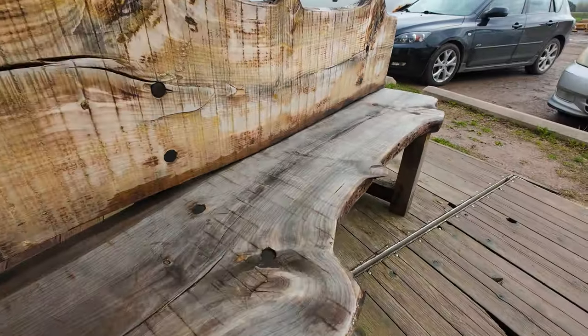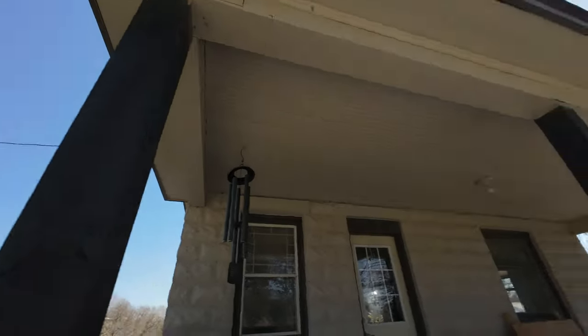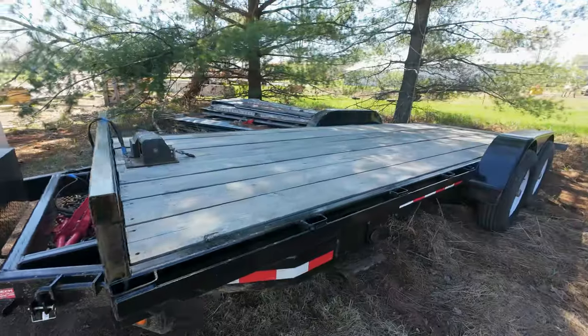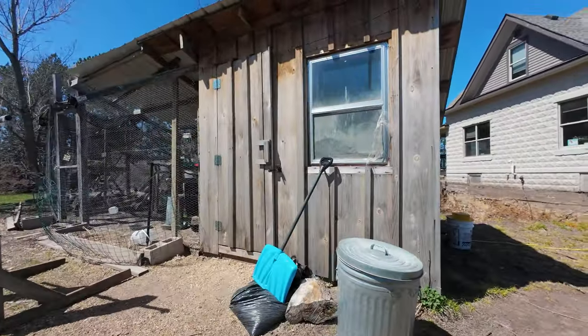But that rough, rustic look is perfect for certain applications like timber framing, posts and beams where some movement is acceptable or even desired. Sometimes many people prefer that aged, natural character. Just don't go building a kitchen using green lumber unless you're ready to watch it walk away on you.